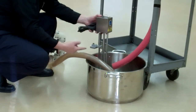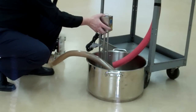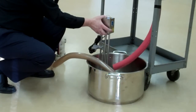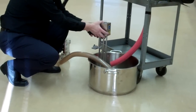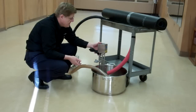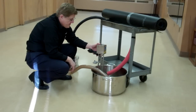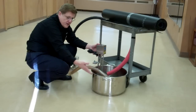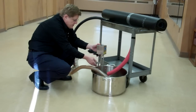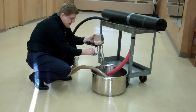When the job is over, the ink is drained back. You take away the trolley — in some cases — or you take out the cylinder and wash the pan in other cases, depending on the machine you have and the year it was built. You now have a bucket of ink that you want to take away and bring a new ink in for the next job, and you can dismount this from the bucket through an easy disconnect.